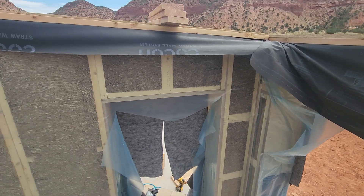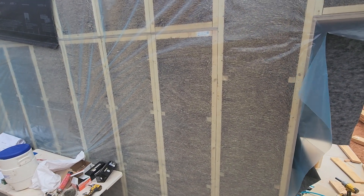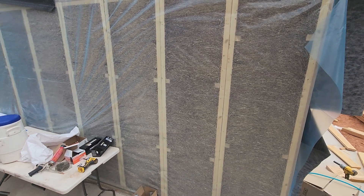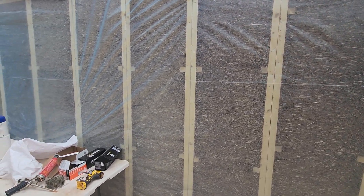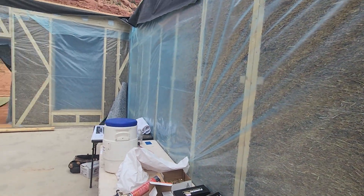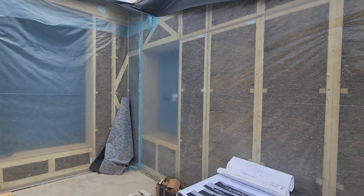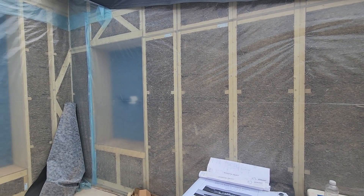So that's how they deal with air tightness on this project — from the exterior. The plastic on the inside is just temporary, just to keep it from getting wet, and when they put the roof on they'll finish that. They'll have to route out the middle of these panels to run all their wiring, or any exterior plumbing — though it doesn't look like there's any on this project. But definitely for wiring, for light switches and all that, they'll route that through the panel itself, similar to a SIPs wall system.